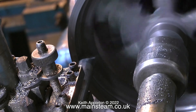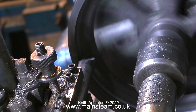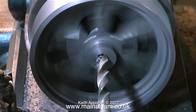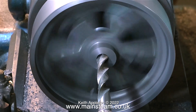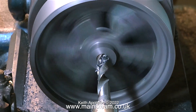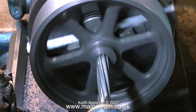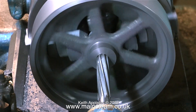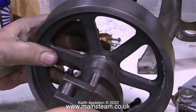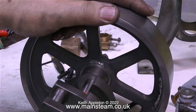I'm going to polish this up. This is the second operation with the boring bar — initially I used it to clean up the inside surface, and now I'm using it properly to get a good finish. I need to make a hole exactly 5/8 of an inch in diameter in the centre of the flywheel, so I'm not just drilling with a 5/8 drill. I use a 39/64ths drill — just small enough that a reamer will follow through and size the hole to exactly 5/8 inch. Run the lathe very slowly with the reamer and it will fit your crankshaft with no shake whatsoever. The rule is: drill the hole slightly under finish size — you could even bore it with a boring bar — then run very slowly and feed in the reamer of the required size.